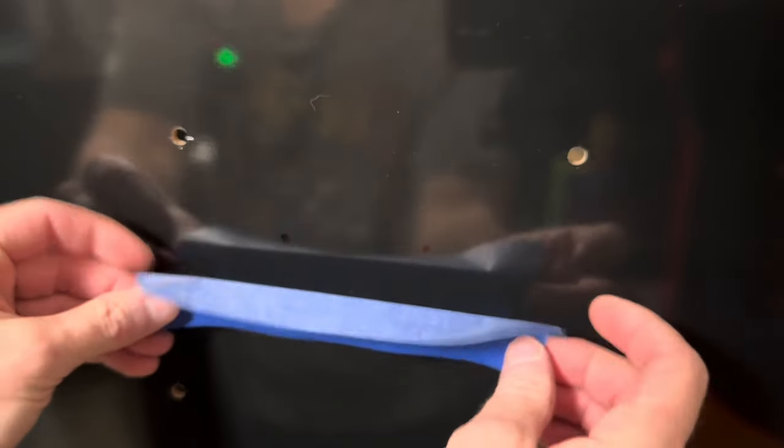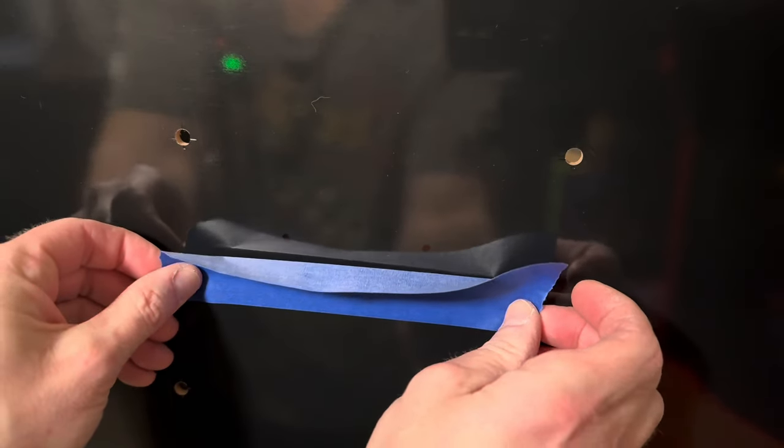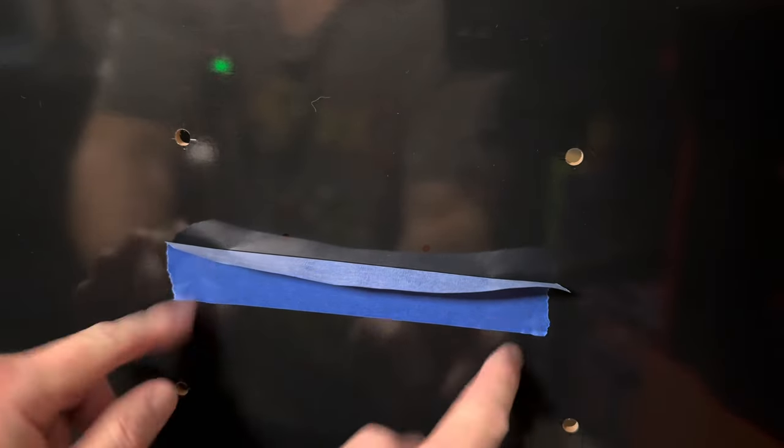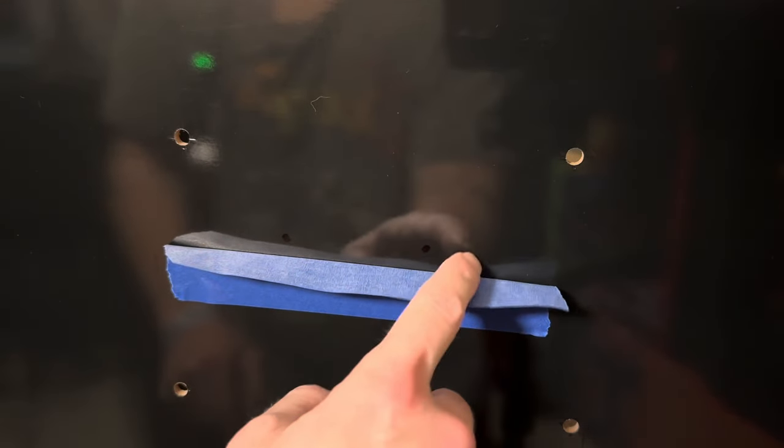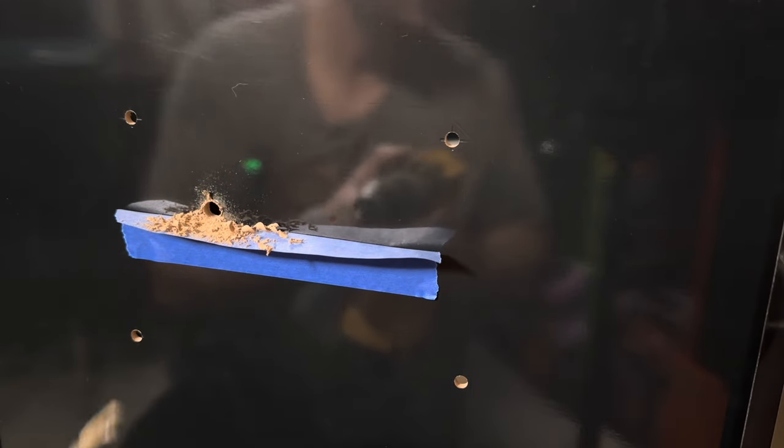You can see the two dots we made with the marker. Another trick that Bea showed in his tutorial: take the painter's tape and stick it right underneath the holes so when you drill through, it will catch some of that particle. Just take your drill and go right in the middle of that dot — it catches most of it.